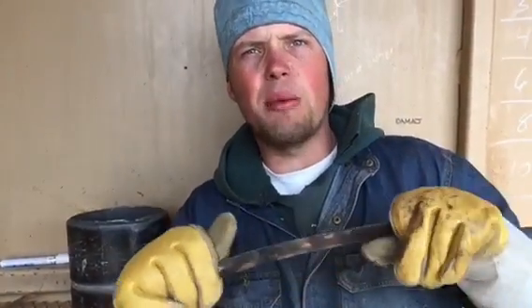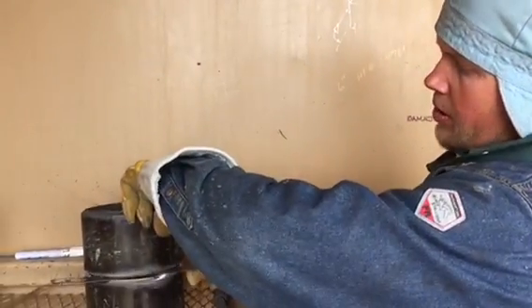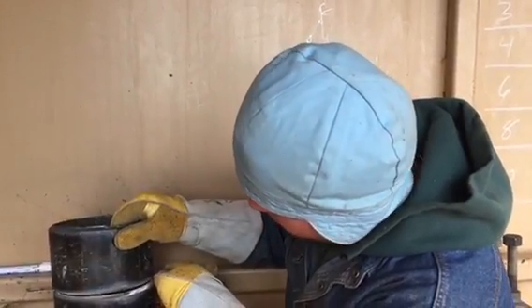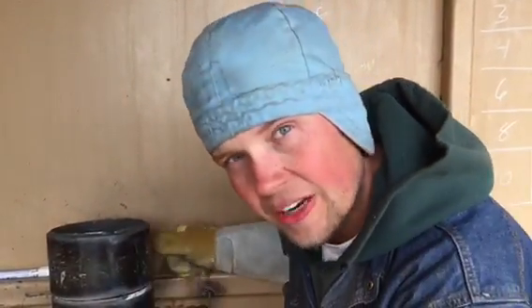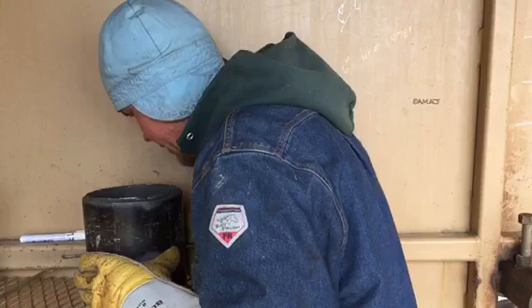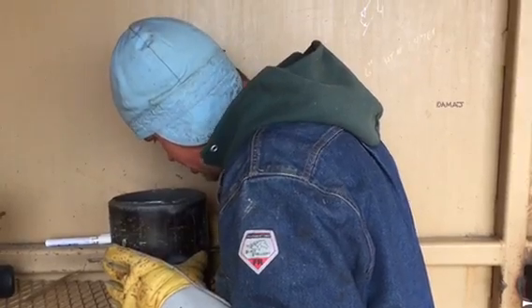There might be just a little high-low on the inside, but just try to split the difference between them. Then what I do is I take a bandsaw blade, hacksaw blade, or sawzall blade — I'm not sure the size — and throw it in here pretty close to the front. That's actually going to make these coupons fall back just a little, which gives you a bigger gap. If you need less gap, put it in the middle. If you need even less, move it back. Wherever you put this spacer is kind of where your gap is going to be. Double check your inside again.